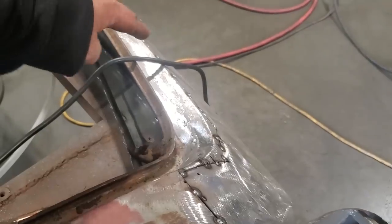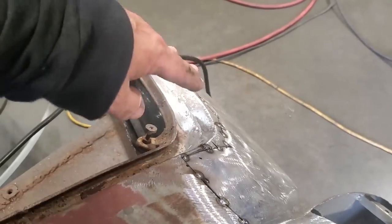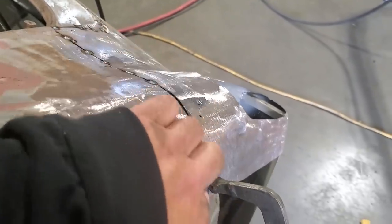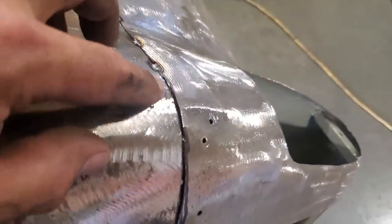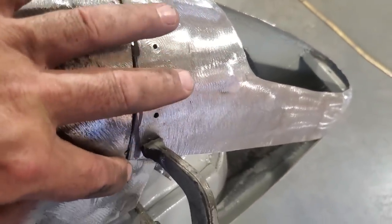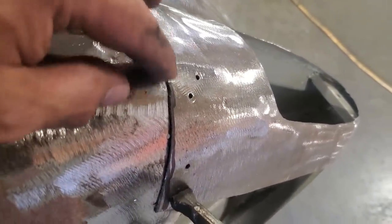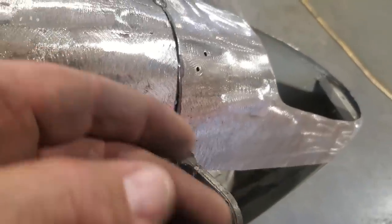So what I've done is I chased the roll in the metal. Like, if you had to start from the middle, I chased it all the way over to here, and now I'm going to push it off the end here. So I'll just go ahead and I'll end up cutting this piece right out here now, right down through here, and eliminating it altogether, and I'll start working this metal just by pulling the panel back and forth to fit this panel here.